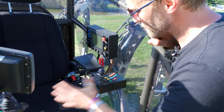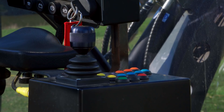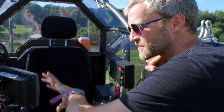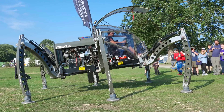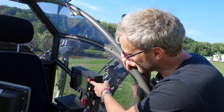Inside the cab there's a joystick on each side and a bunch of buttons — unlabeled, just to confuse people — on a CAN bus that talks to a robust TFT touchscreen with buttons down the side. That's the operator/driver view panel where you can see everything going on, select modes, and get prompts from the Hex engine like 'do you want to power up?' On the left is a more basic control panel with RPM, flow rate, oil pressure and temperature, plus the big kill switch and key start — more like a normal engine control panel.